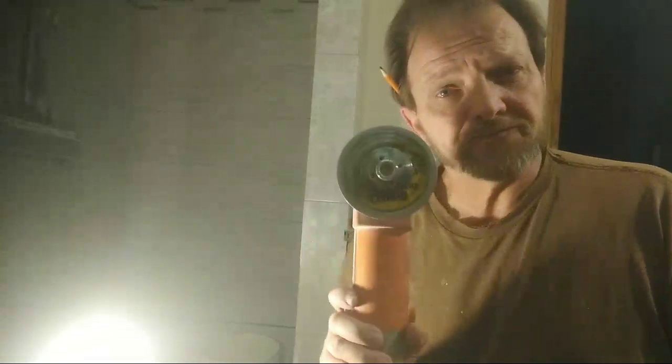So you've got to see my first video on this. I'm not talking, I'm just doing it and showing you that process. Now the first thing you want to do when you create a bullnose, I don't care if it's on a piece of wood that has a rectangle, a square edge, or if it's a piece of tile, it's all the same. Except on a piece of wood, you generally are not going to be using a grinder. You'll be using a palm sander in most cases.